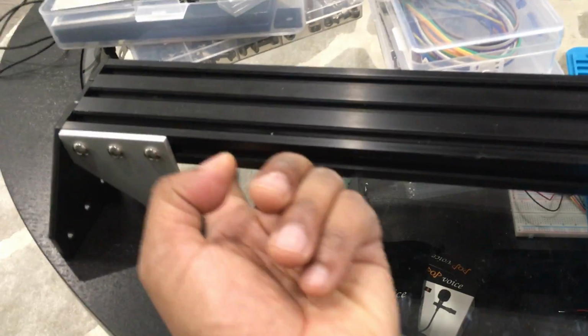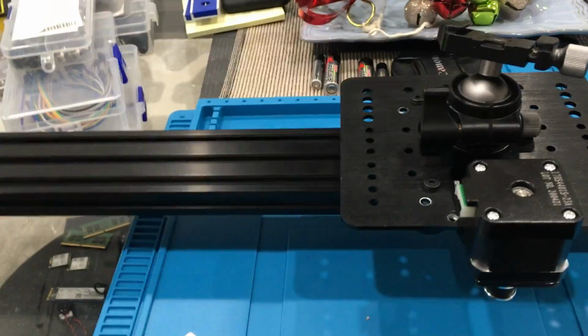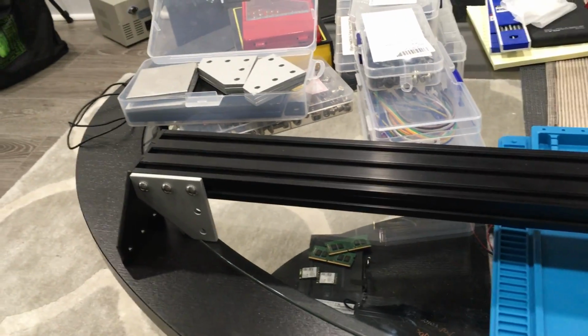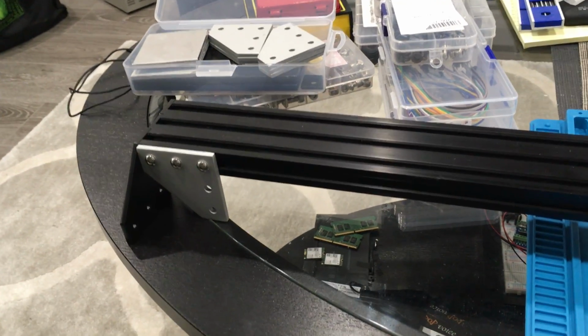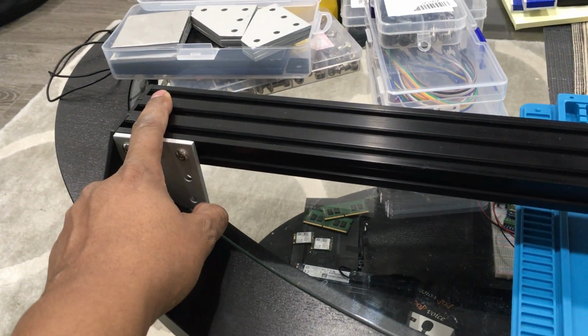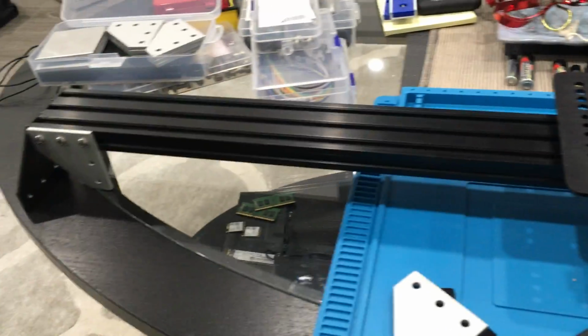I'm also going to put a small plate on the underneath going across the slider at each end and in the center. And I'll have a 3/8 hole thread in there, so that I can attach it to a tripod if I need to have the slider at a higher level, instead of being on the ground.